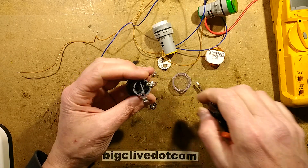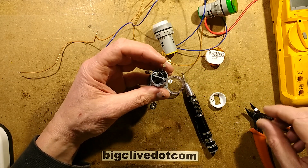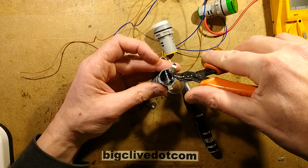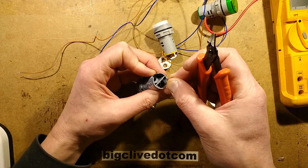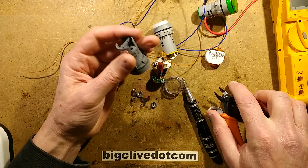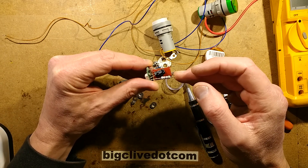These would be ideal in a panel with a three-phase supply, because normally when you drop a phase you get a voltage anomaly — the phase that the fuse has blown will get backfed from the other two phases, and you end up with a weird voltage reading that confuses a lot of people. So — quite a big capacitor. There is the sense resistor as I predicted, the inrush limiting resistor, and a fuse.